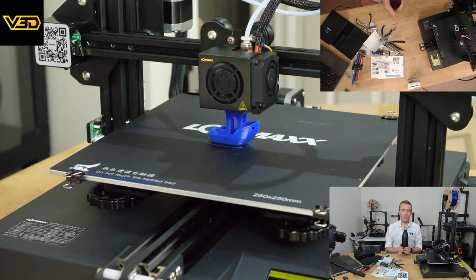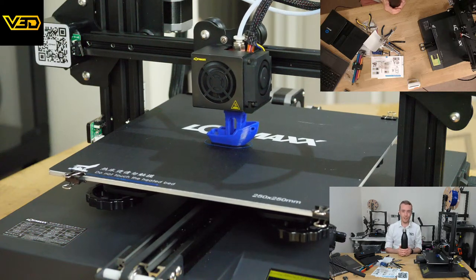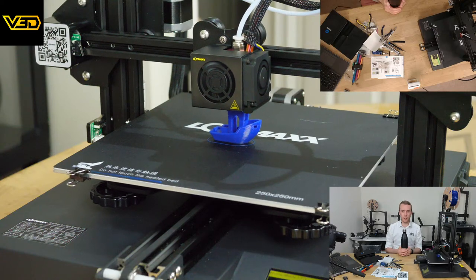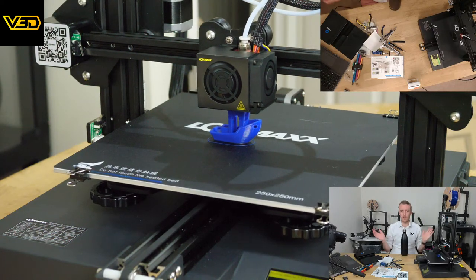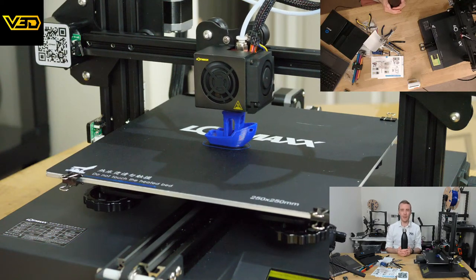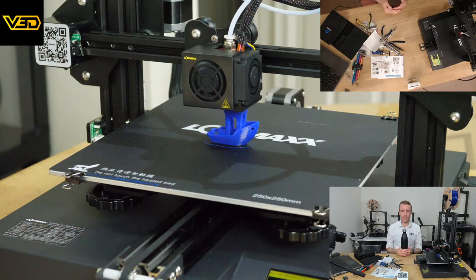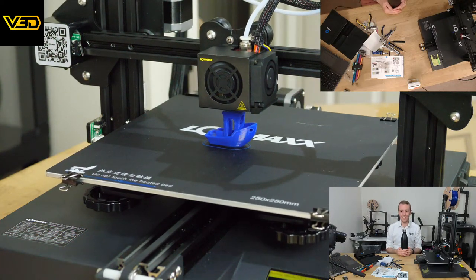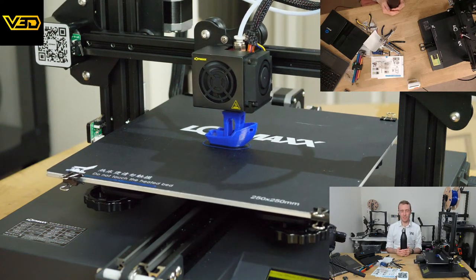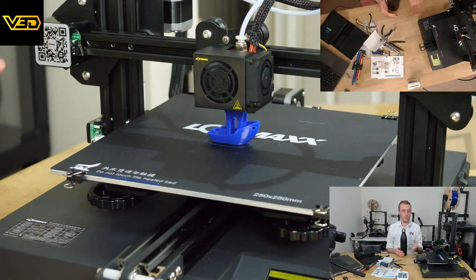And you're right, it's an interesting topic, because linear rails can hold a huge amount of load. I can't remember the exact spec, but the ones I put on Extrudinator do something ludicrous, like 400 kilos per carriage, and that's like 100,000 hours of functionality. And I'm putting 6 kilos on. The demands of 3D printers are exceptionally low. That's why printing can be so cheap, because it's really slow.